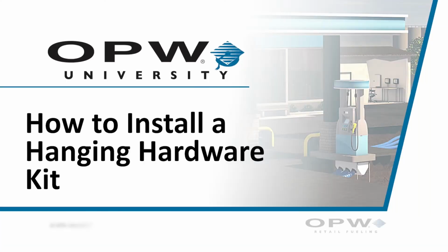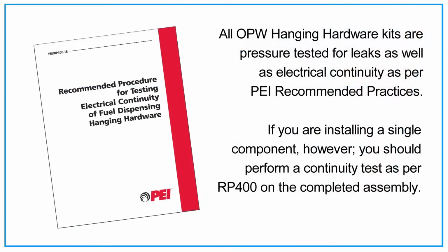In this video, we will demonstrate how to safely change a hanging hardware kit on a retail fuel dispenser. It should be noted that we will be installing a complete hanging hardware kit rather than an individual component in this video, and all kits have been pressure and continuity tested at the plant. But if you're installing just a component, you should follow the testing procedure found in RP 400 after the installation is complete.